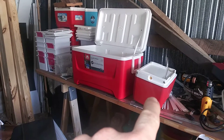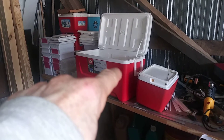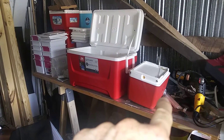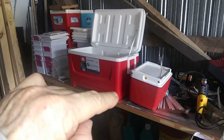With the small ice chest, the ice float level is only going to be maybe six to eight inches at most, and the water level is always at the bottom — probably only three to five inches. But over here on the large chest, your warm water is going to be at the bottom when your ice is floating on the water up higher. So if you leave your drain open at the bottom — as long as it's high enough to maintain enough operating water — just open it up and let it run. The ice level will come down but the water level at the bottom will always stay coldest. That's the tip for today, and I highly recommend it — it's one of the easiest improvements you can make on a large ice chest air conditioner.